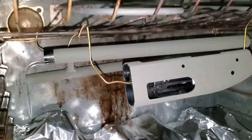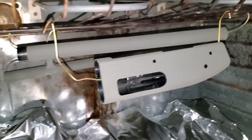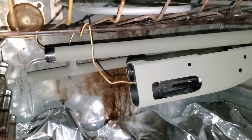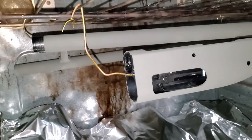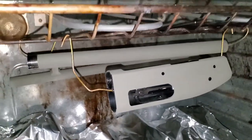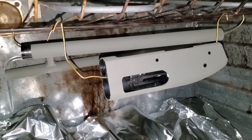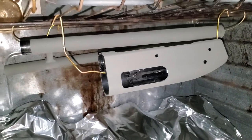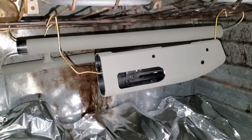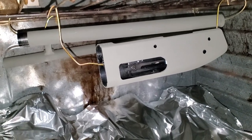You can see I've got the parts hanging in the oven. All I used was some old clothes hangers — just made hooks out of them. I'm going to bake it the first hour at 250 degrees, then up it to 300 for about 30 minutes, and that shall do it. Let's get curing.